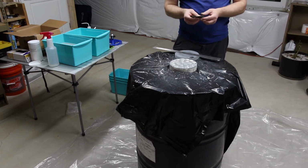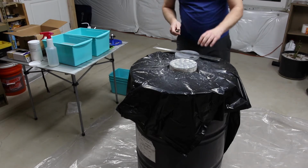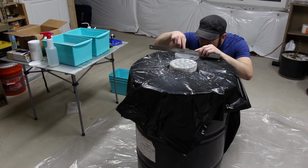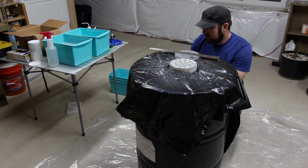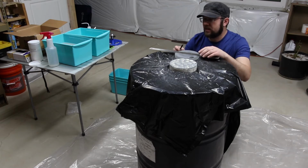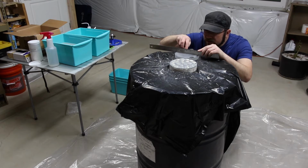So I'm going to start with one that's around 20 thousandths. Let's see if I'm even that far. Can I slide that puppy underneath there? I can. How about that? Just a little bit of extra space under there. So we'll bump this up from 20, let's try 25. Might need to take these feeler gauges apart too so I can get right in the middle. How about that? That actually also fits underneath there.